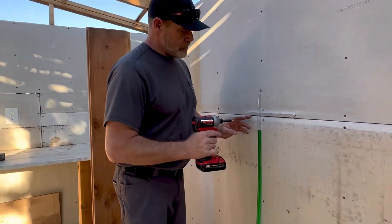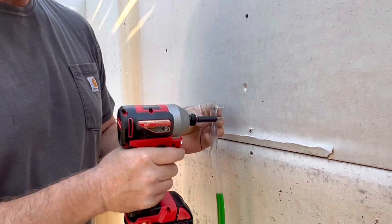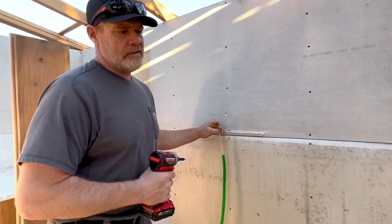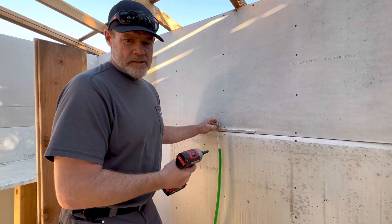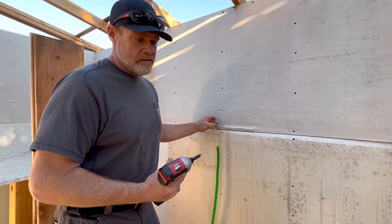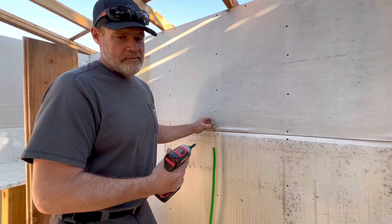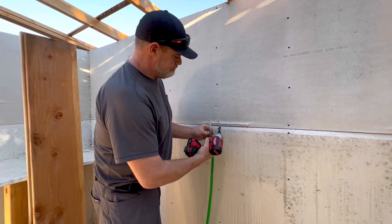This is a great way to check lasers and levels. Water doesn't lie. Gravity doesn't lie. You can just drain it out or cap it and keep it on the job site. And another thing — if a self-leveling laser isn't in your budget, this hose cost me $13 and food dye, probably a few bucks. So a $600 or $650 laser compared to probably $17. This is never wrong — flawless every single time. I do like the lasers; they make everything convenient and fast. But I just wanted to show you guys how a water level works. Thanks for watching.